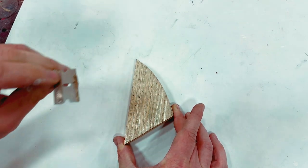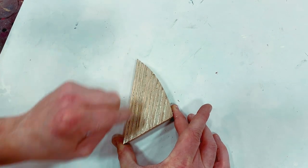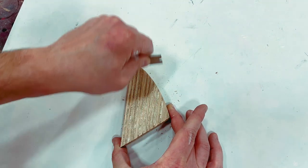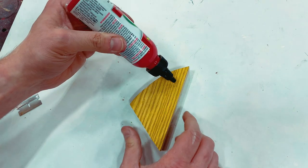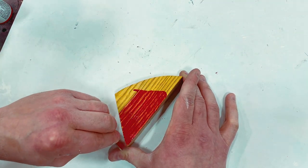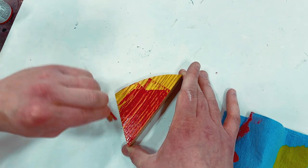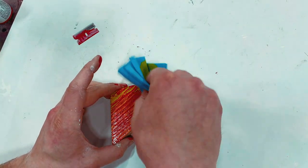So this is the one I did that gold acrylic thing on — don't judge me. It's not the best idea I've ever come up with, but it actually ended up pretty cool. You've got this cool kind of gold accenting technique for the grain. Would have been neater probably in silver, but I'm going back over it now with a razor blade and scraping off all the excess, exposing the wood on top. And if I went over this with a candy — something like that Heritage Red — I'd probably end up with a very interesting finish. I may have to try that at some point. This is the sealed NGR dye stain — all Mohawk products. The stains are Mohawk, the sealer is the easy vinyl sealer from Mohawk. I'm going to do three different things here: first, I'm going over it again with the red wipe-on dye.